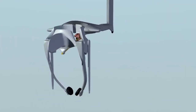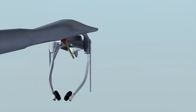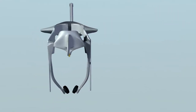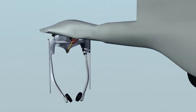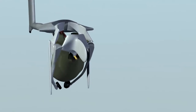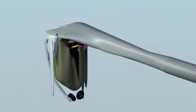Retractable landing gear are hinged at the primary structure and tuck inward to wrap around a fuel tank. The suspension struts are connected together by a shaft passing through this primary structure. A tail boom with vertical fin and tail wheel is connected to the backbone. The fuel tank shown in green conforms to all of the surrounding structure and provides a boat tail shape behind the gearbox when in an airplane mode of flight.